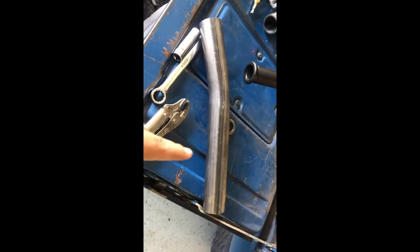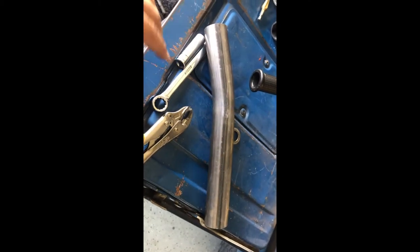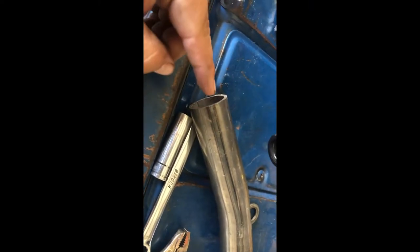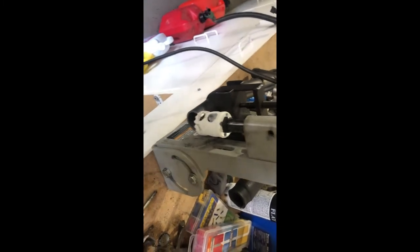Up and over to the back. When I start notching all these pipes — there's a longer end and a shorter end with a little kink right here, there's about five of these and one long one. I'm going to be notching all of them on the shorter end. There's like a seam weld right here — I don't know what that is, but there's a line I'm using as my center. That dark area is going to be right centered up here, and you'll see there's a little triangle right there that's kind of what I centered it up on. Then all that's left is to start notching.